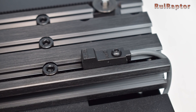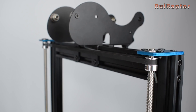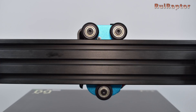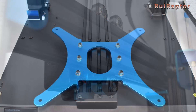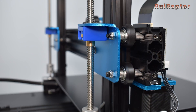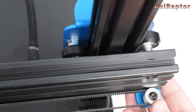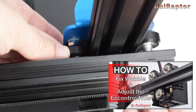The end stops, like on the first version, are all electronic. Before we can print, we need to go through some adjustments. We need to check the wheel's grip — the printer has wheels on all three axes, but only some of them are adjustable. You can adjust the grip by turning the eccentric nuts. For the X axis, the adjustable wheel is the bottom one. On the Y axis, the carriage has six wheels and you adjust the three wheels at the right side. For the Z, you adjust the inner wheels. The wheel grip adjustment is very important — too much grip will make the wheels deform, and too loose will make the carriage wobble. We have a video that explains the best method, so check the link below in the video description.